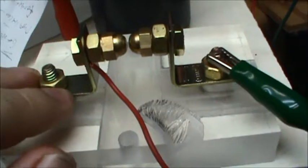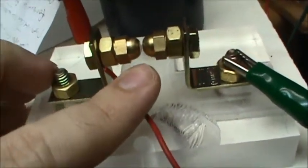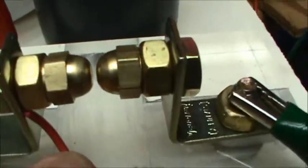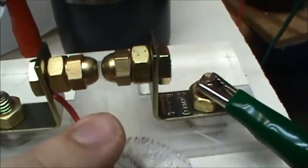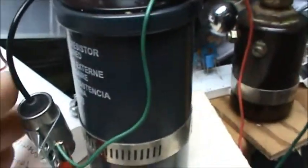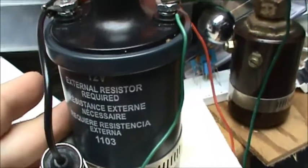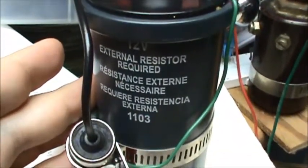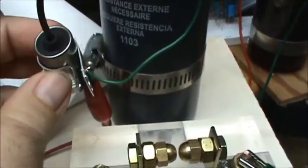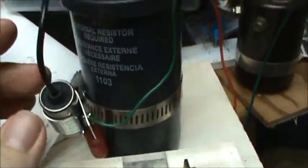So I got these L-brackets there — I think brass plated — just to try to have a nice round spark gap. You can see how small it is and the sparks were just able to jump across. Now this is your average 12-volt, external-resistor-required coil, but what I think they actually meant is external condenser or capacitor, and that's this piece here, because that's what's actually needed to make this work.